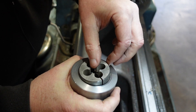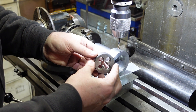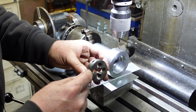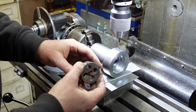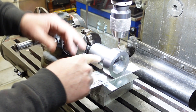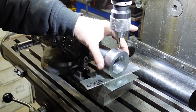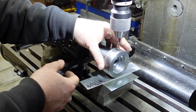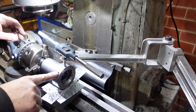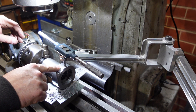All I have to do now is put in the tapped holes to hold the die in - big grub screws or headed screws to locate in the dimples on the die. Depending on what dies you have, the dimples can be arranged various ways, so I'm going to put five holes in here spaced 45 degrees apart and that'll cover most configurations. Over at the mill with the dividing head: the stack of material is just to support the workpiece hanging out the front. I've centered it, got a 5mm drill in for M6 tapped holes. I'll drill those and then use the tapping arm to put the tapped holes in - the tapping arm is invaluable for keeping the tap square to the surface.